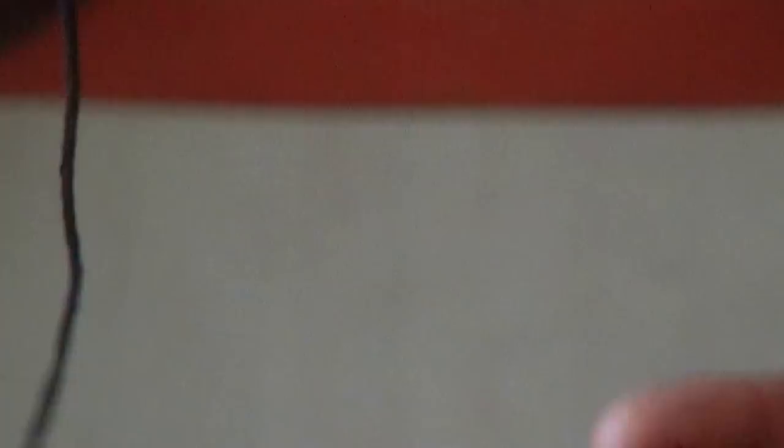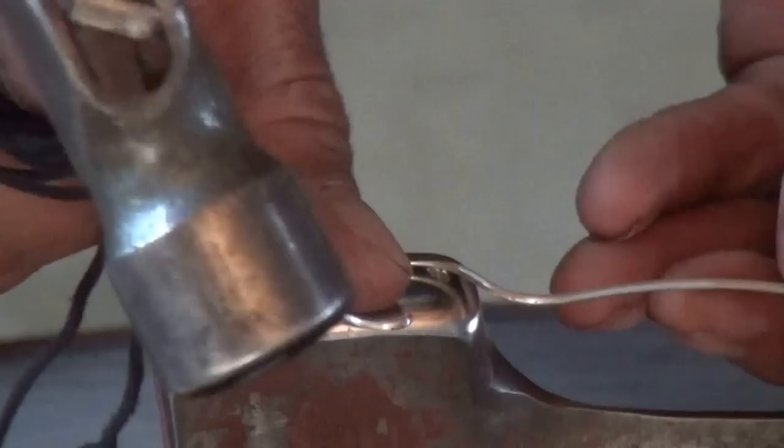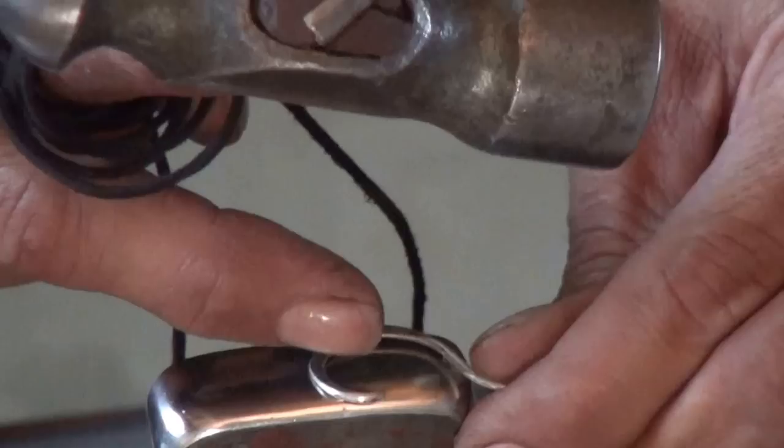This is kind of out of whack on purpose. I want to show you guys how the angle of the hammer will close everything back up. I'm going to hit it at this angle here. It depends on what part I hit it on — if I hit it here this hook part will close up; if I hit it here the whole thing will close up. So I'm just going to close it up a little bit.